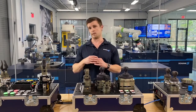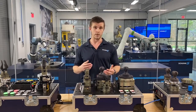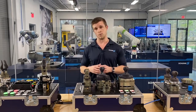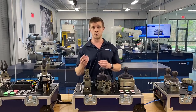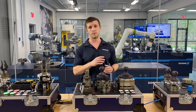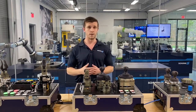We also have issues where all these tools have tubing and wires, but the robot wrist may be rotating. With all these components that have tubes and wires, they can get tangled up. So what we want to do is distribute air and electric signals through a rotation feed-through, where on our tool end all the cables and tubing move together, while our stationary end is attached to the robot. This allows for 360-plus degrees of rotation so we can continue our process without any issues.